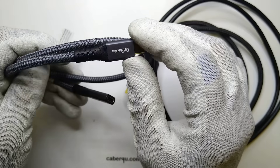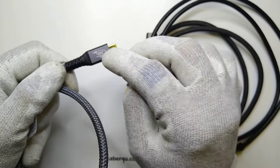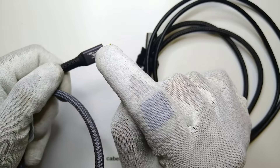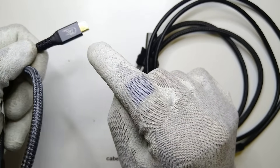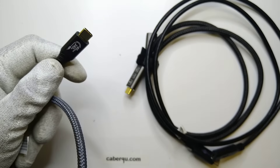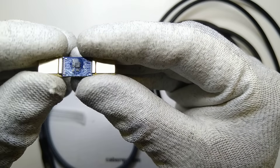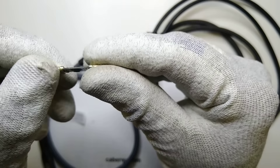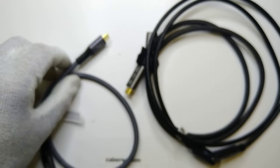This practically means that if it's according to the USB Power Delivery standard, this cable needs to be able to advertise itself as being capable of doing so. This means there needs to be an integrated circuit inside that can communicate those capabilities — and those chips are most of the time directly molded into the connector itself. You can see this with an adapter board where the chip is on top, advertising itself as capable of doing 100W, 240W, 40 Gbps, 80 Gbps, or similar.